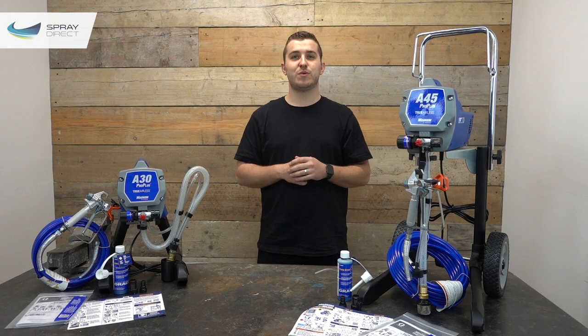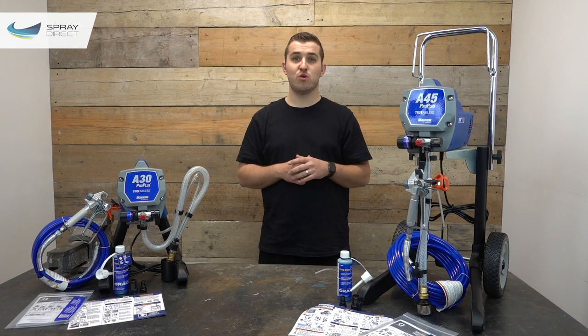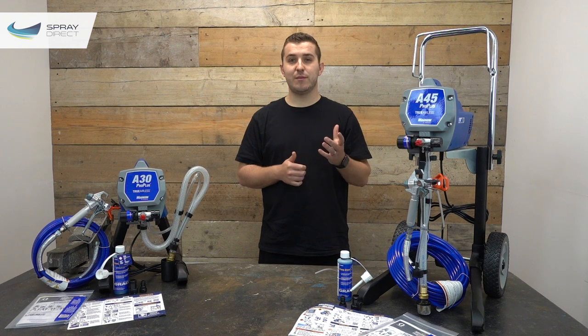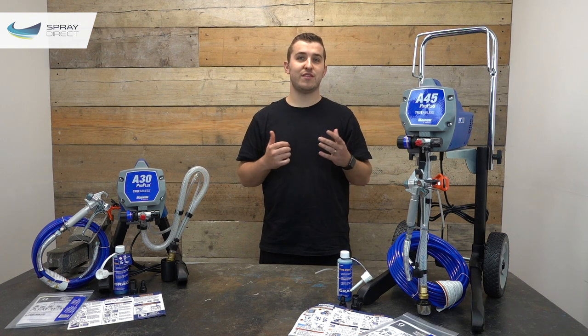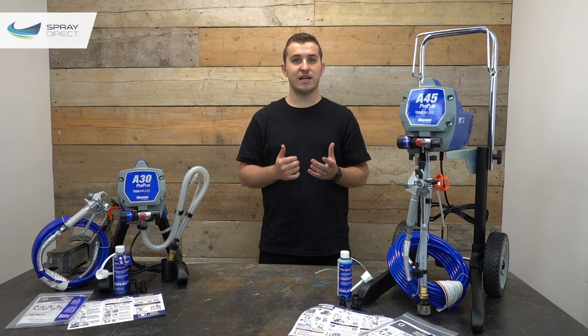The A30 can also spray at really high pressure, even when compared to the professional units. It's capable of spraying all the way up to 3000 psi, or just over 200 bar. Don't get me wrong, it's not great practice to be spraying at this kind of pressure unnecessarily, but I'll show you in a few minutes how we set our pressure correctly to reduce overspray, paint wastage, and wear and tear on the pump.